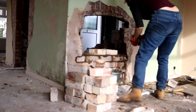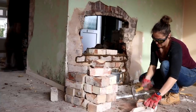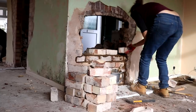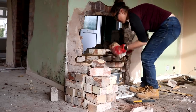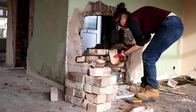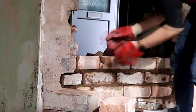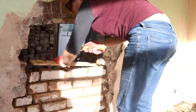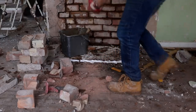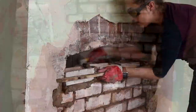And when it came to needing to trim any bricks down, and because I don't have a brick cutter, I would bash the end with a hammer until it would slot in nicely. But definitely wear goggles for that, because you don't want shards going into your eyes. And I'd carry on adding gobbo and mortar in between them. I did ask whether we needed some X-shaped metal pieces, as I've seen before for bricklaying, but apparently we didn't need it because we were keying it in. But like every DIY project, you need to do your own research. Also, sometimes chipping away with a hammer can completely destroy the brick, but because we had so many, I'd just try again. And whenever I ran out of mortar, my dad would just go and fill up the bucket and bring it to me just to make life easier.